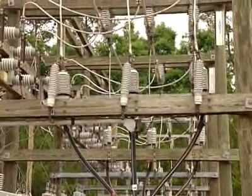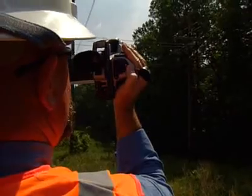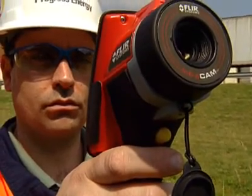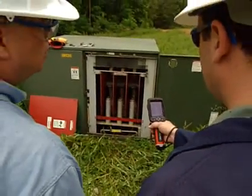Switches, fuses, fuse cutouts, capacitor banks, lightning arresters — things heat up before they blow up, so with infrared you spot them. Today I had the opportunity to use the infracam. They're more affordable. You can buy more cameras for the money and get more cameras out in the field on the trucks where they need them.